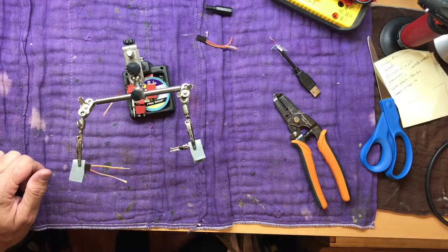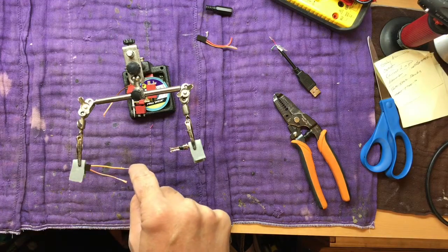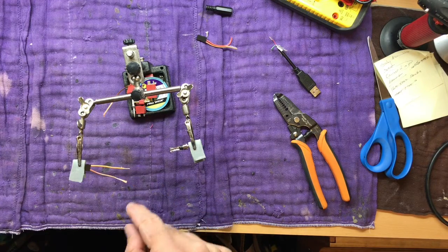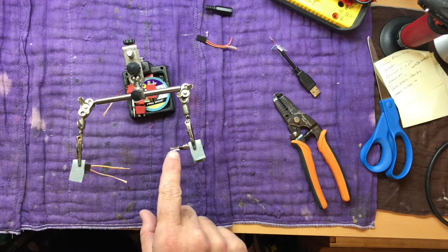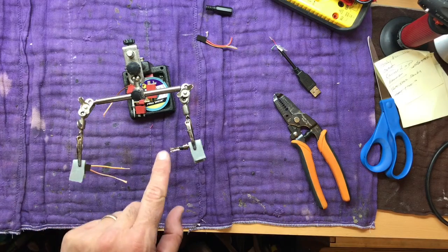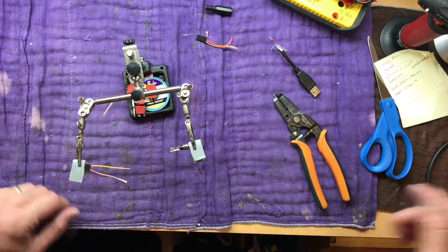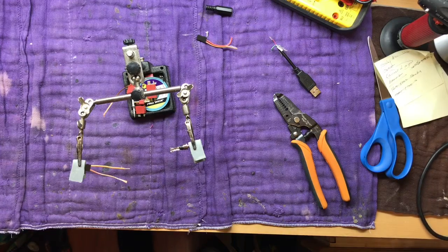This may or may not make the final cut, but I figured I'm only doing this once, so I might as well video it. So I went ahead and stripped off about 1/4 inch of the shielding from the signal wire and about 1/2 inch from the negative. And we're going to solder this up. So remember, I had marked this one right here as the tip. And so ground and the right tab is going to be soldered to the longer ground wire. So the first thing I need to do is just tin up my wires here.